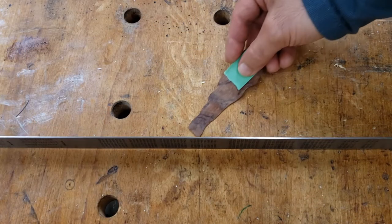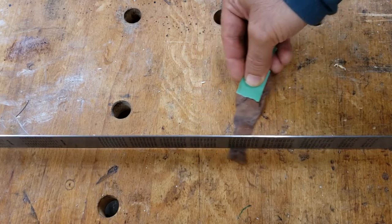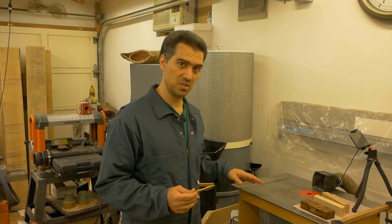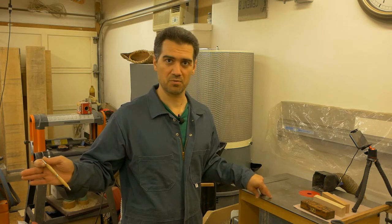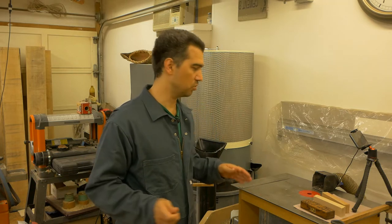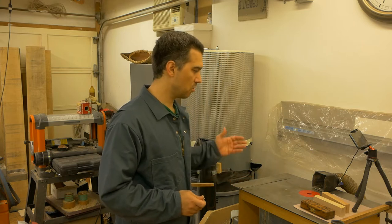Let's go to the workbench and repeat the same experiment but this time with a longer ruler. We can see I can fit an entire width of a veneer at the center, so the workbench is definitely not as flat as it could be. My table saw is another flat surface but it has a lot of cutouts for various tools and attachments, so it's not as convenient to use as the router table.